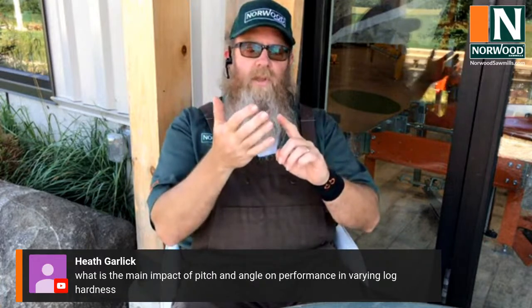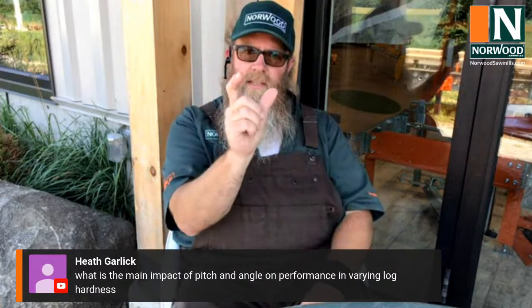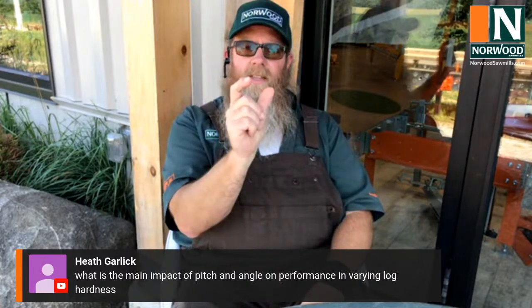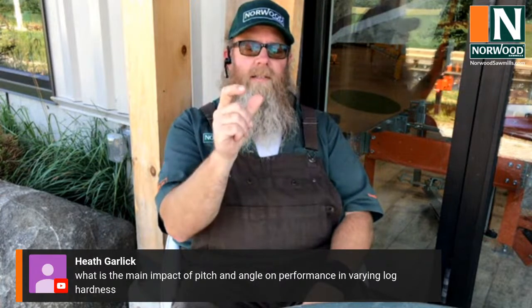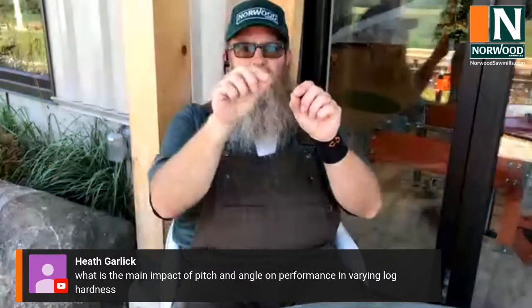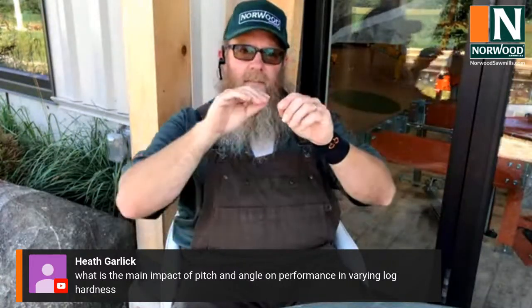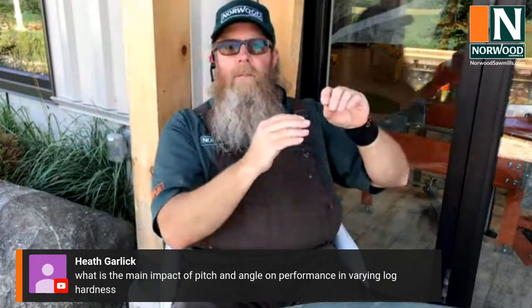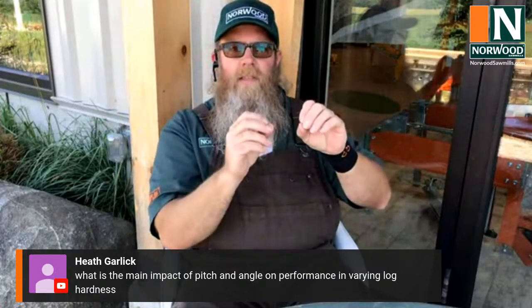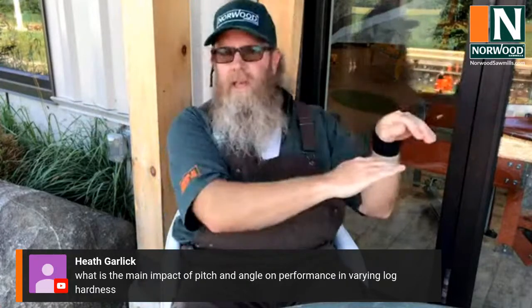And if you put a blade pitch into something where the spacing is too tight together and the chip is too large and it's sticky, what happens is that the gullet of that tooth isn't just a U that they randomly picked the shape up from. It's there because it's meant to take what you've cut and fire it out of the gullet and get it out of the way. When you nose it into something that doesn't match the pitch, it can't get it out of the cut quick enough.